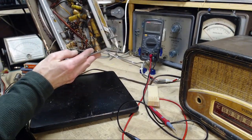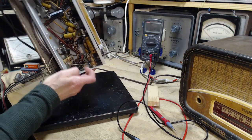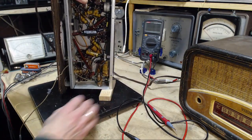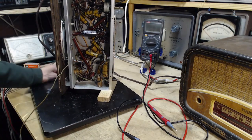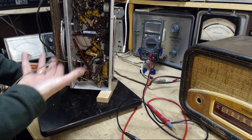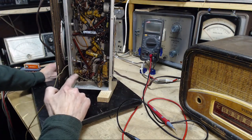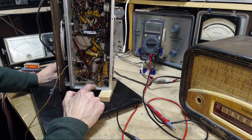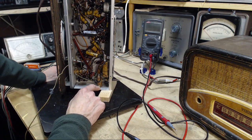So it's this coil, and I can see a wire coming down from it, meeting here. Now what's that coil? That's pretty certain to be the antenna coil. You can prove it a couple ways. Let's see. So here's the antenna coming in through this capacitor to this coil. So this is the antenna coil. So this must be the oscillator coil, the oscillator coil with a grounded connection.